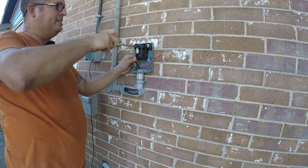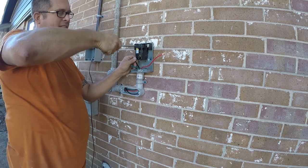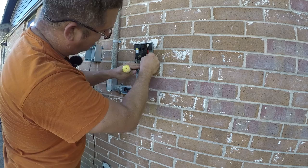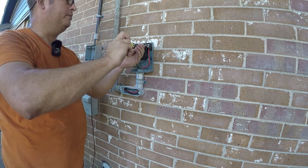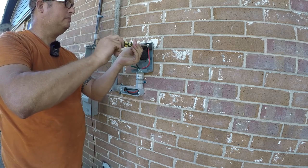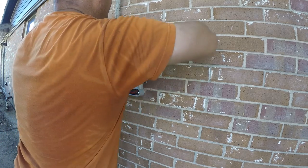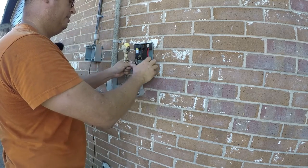You should not have an excess amount of wire sticking out from the terminal. It's just bad workmanship. And you want to get them nice and tight. Now, if I could have found it, I would have used aluminum wire for this because it's substantially cheaper than copper, and it's just fine as long as it's a modern aluminum wire.